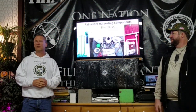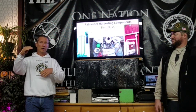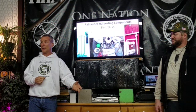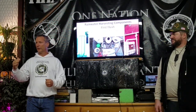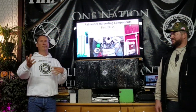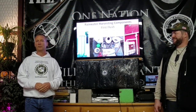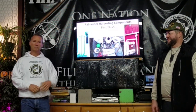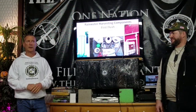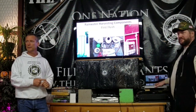So that's all fine. What you don't want is for it to stay full or have somebody go out and empty it out, and then a week or two later you forget to empty it and you shoot all of the bird crap and pollen and all the other crap into your storage tank, because then it's going to clog up your filtering system down the line, if you have one. Any other questions before we move on?